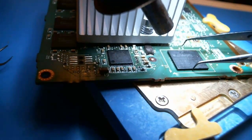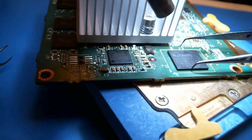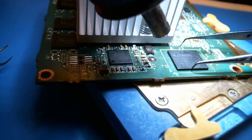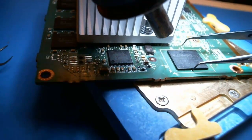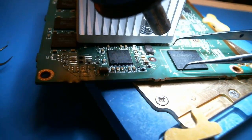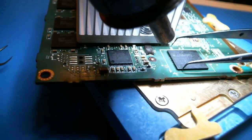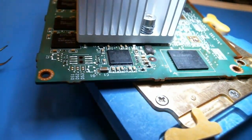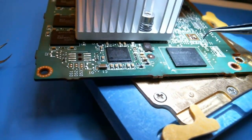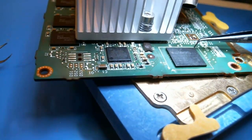I'm showing you guys how to re-ball this thing. I don't know much about it in terms of the Linux side — there's a pretty big thread on it somewhere, you just have to do a search for it. I'm re-recording this with narration. The guy ended up buying another NAND drive, which is what I'm soldering back on, and he somehow reprogrammed it — having the log write to tmpfs instead of a file, so it doesn't kill the drive when it fills up with logs again.